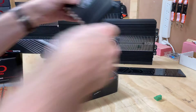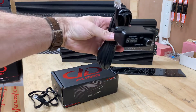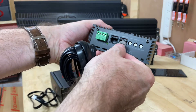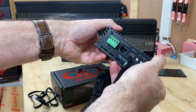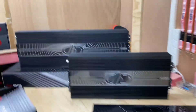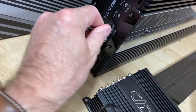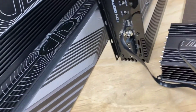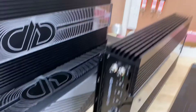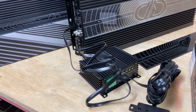So first off, that's your little power plug so you can plug in there. You can see here you have a remote out and remote in. Here's your remote that comes with either the M5A or M3D — you plug that into your in, like so. Then you can see you have an output and you can plug that into the amplifier. So here's our amplifier — I'll just plug that into there. What we've ended up doing is you've now got your base controller, which goes into the module and then goes off to this one amplifier. All your five amplifiers are running off their bridge setup like normal, all powered off this one box, and then your base controller will run all of them.